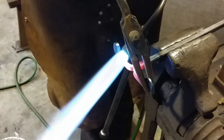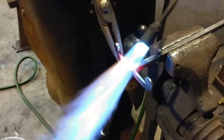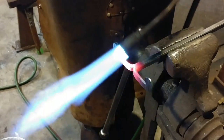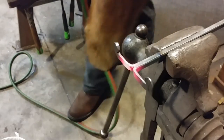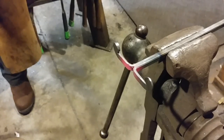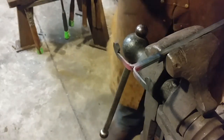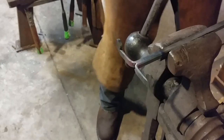So we're going to straighten these up a little bit so they look nice, and then they're going to sit square to the pan of the shovel. There we go. As you can see, I left a little bit of a crook in there, and a little bit of an arc. I did that for a reason — part of the reason is because the one that the customer bought, in the picture that I sold to them, that's the way the product was done originally. But the reason why I did that originally is it gives it a nice transition point, a nice transition and roll out. So I'll unclamp this from the vise and let you get a look at it.